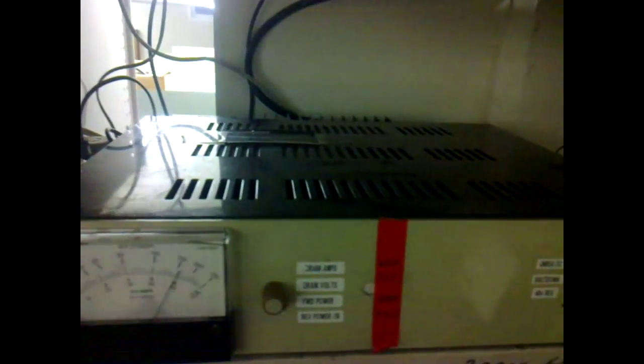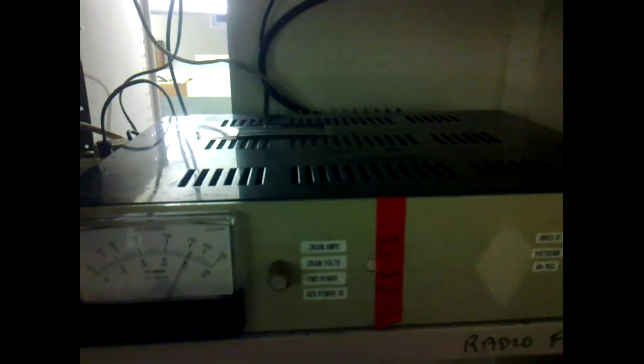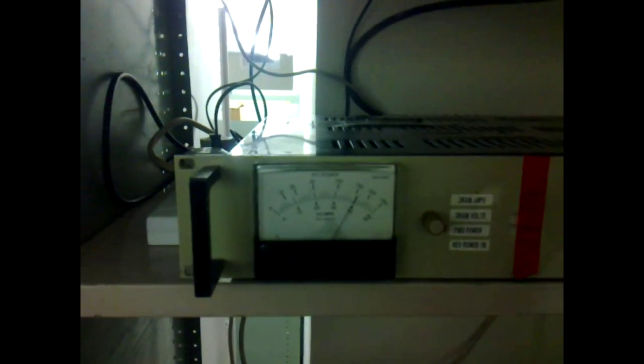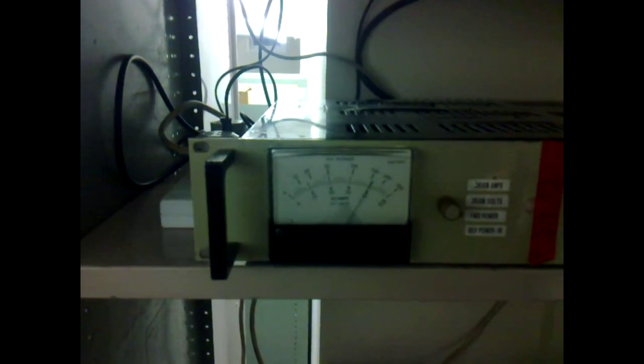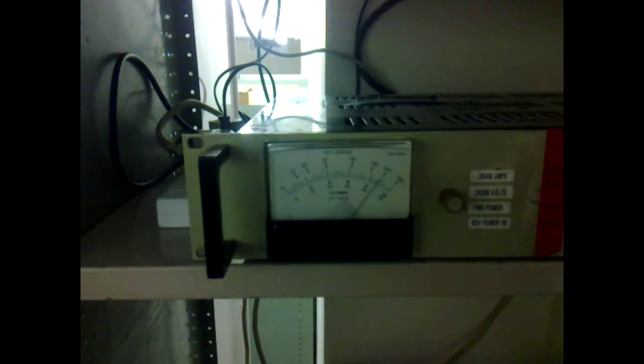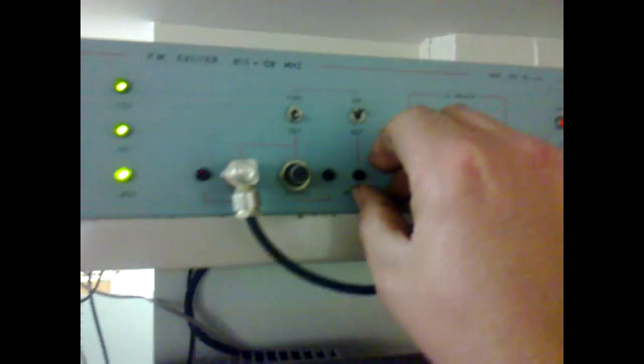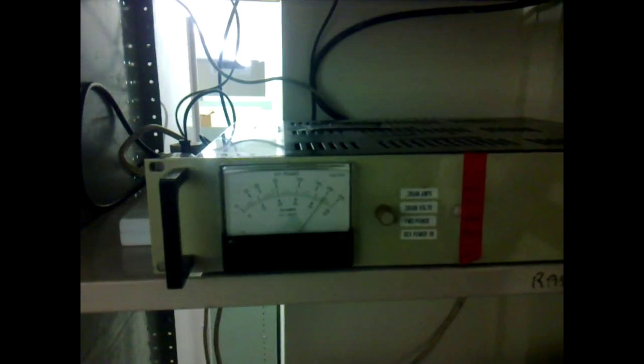The actual transmitting transistors are on that little board over this side, on all that little coppery stuff. They're in there somewhere. But nevertheless, this is working so well, I'm going to wind up the transmitter back to the full 200 watts. So let's watch that, eh? There we go, tweaking it up. Just tweaking it up by increasing the power output of the exciter. Of course it drives the linear harder.